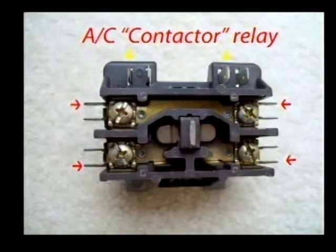Now, as you probably know, the way a sight glass works is that you can look through the little glass, and when all the bubbles are gone, it's full of Freon. However, a lot of these new units cannot be charged that way. They have to be charged by weight or other methods. So I don't necessarily recommend doing that using a sight glass. However, it did work fine with me.